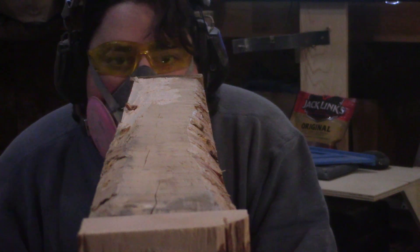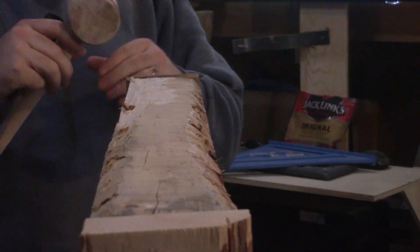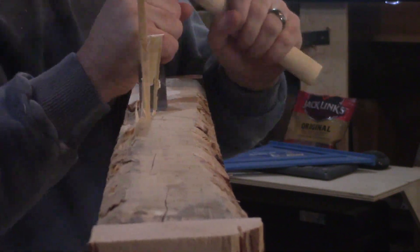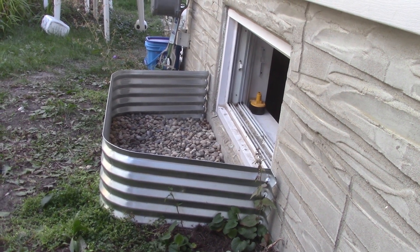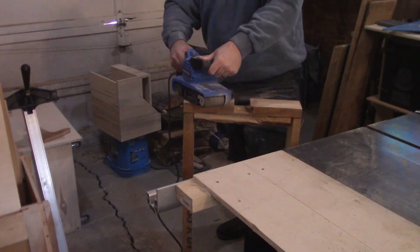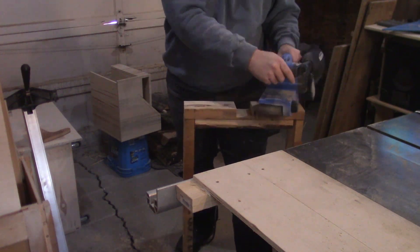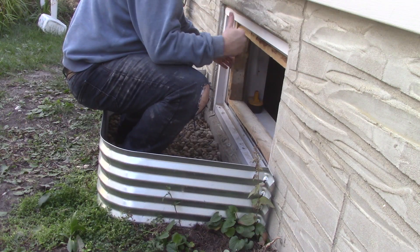With the dados cut out I build out the frame with screws. Since the two-by-fours I'm using are old pallet stringers, they're a little bit warped and beat up, so to take care of some of the warping I shave off some of the two-by-four with a chisel. After a test fit the frame is still a little bit too big for the window, so I break out the belt sander with a 60-grit belt and shave down the sides and screws as needed. Once the belt self-destructed I figured now was a good time for another test fit, and it was good to go.